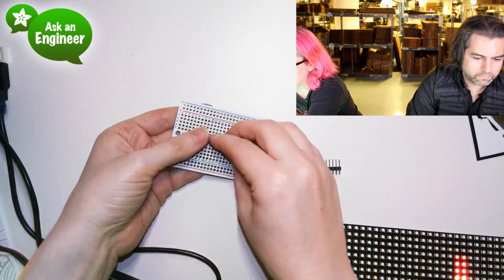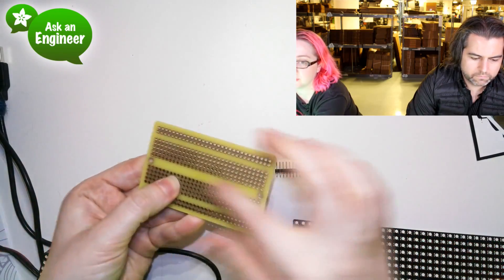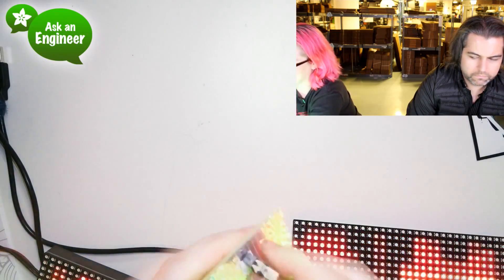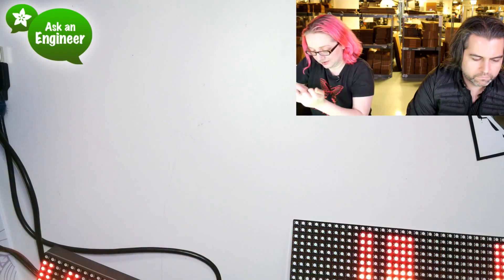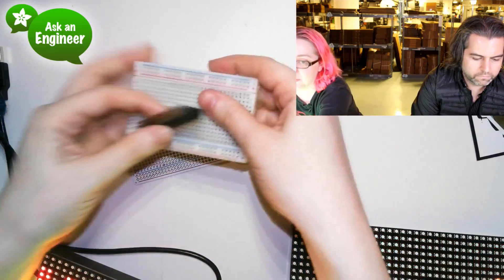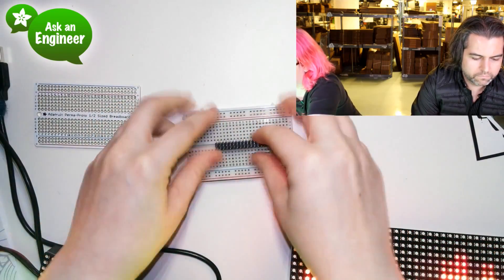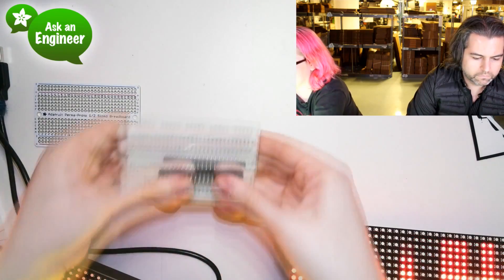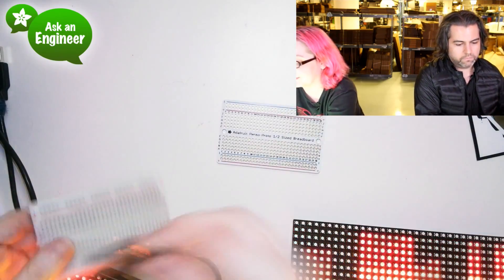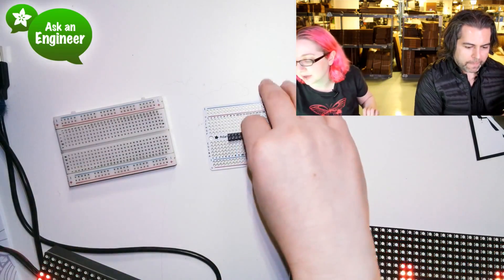You've probably experienced this frustration. What's nice about this is it's a little socket that is exactly 0.3 inches across, so it plugs across the breadboard and you can plug the header in. Then you can plug in an IDC cable into a perma-proto. I personally used it with solderless breadboards — as long as you press it in it'll stick, but sometimes it doesn't. It's perfect for use with perma-protos and solderful breadboards. It's basically like a ribbon cable helper or IDC breakout — very simple, low cost, but works really great.